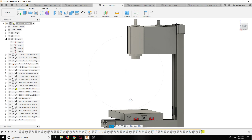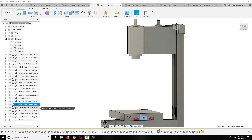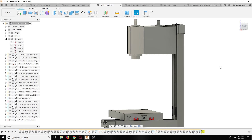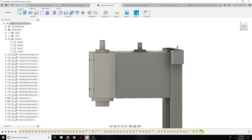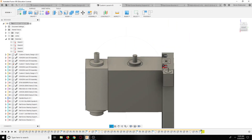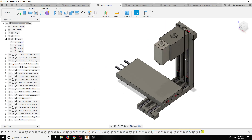Let's look at this one more time - something changed. Let's update that and see the weight. The ball screw bracket mass is less than a pound, pretty close to a pound. That's going to add up to about three pounds - that's kind of one of the last components. We have ball screws here that need to be added with one bracket each, plus bolts, a belt here, and a belt here with a pulley.